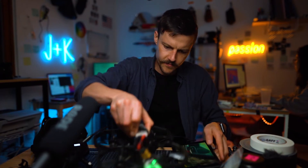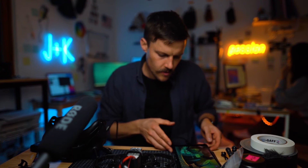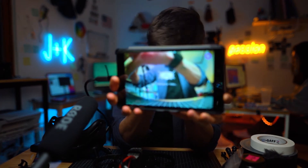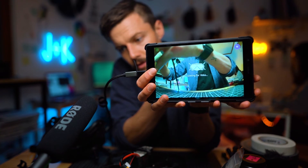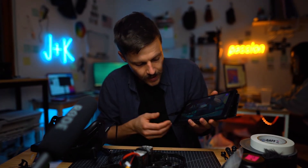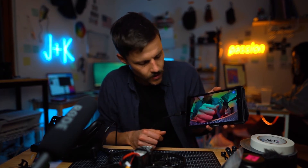I'm going to unplug from the goggles — it says 'goggles disconnected.' I already had it plugged into the tablet, and then I plugged it into the goggles, and I think it's going to get stuck saying 'waiting for video.' That's what was happening earlier. So it does depend on which one you plug in first. This could also be because I'm using a micro USB instead of USB-C to USB-C. Now I'm going to unplug and plug it back in — and now it's working.